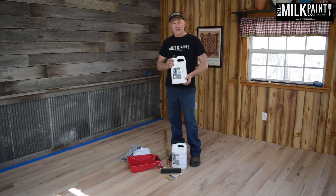We're pretty much done here for the day. Tomorrow we might come back and do another coat or two depending on how much the wood looks like it will absorb. Pretty easy process — really easy to use the Half & Half tung oil and citrus solvent. You can see the color that popped out of this floor in just a short period of time. It really gives your floor a lot of life. Half & Half: pure tung oil and citrus solvent.